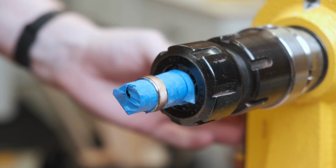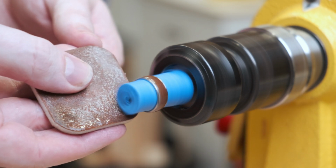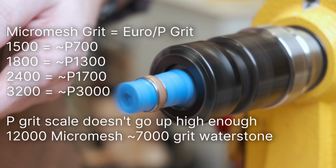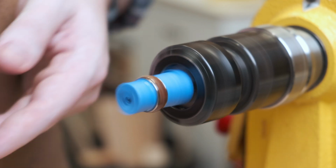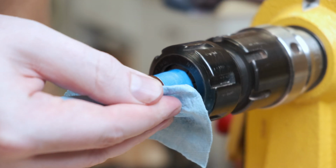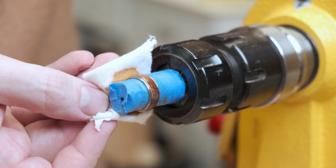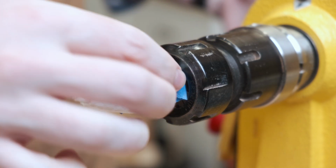After sufficient coats are built up, wet sanding with micromesh is the best way to buff anything on the lathe. Micromesh has their own grit system, but it's simply a process of working through the colour-coded soft pads with a drop or 2 of water on them. Afterwards, for a final bit of shine, Brasso can be applied, left to haze over, then burnished into the surface. This needs a little bit more pressure than the micromesh pads, but not too much.